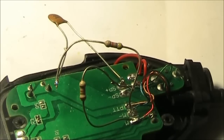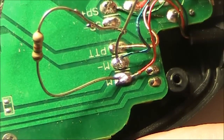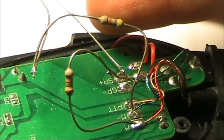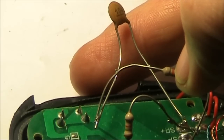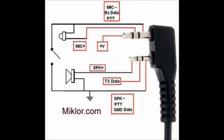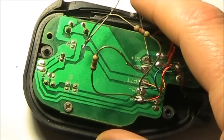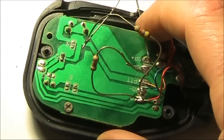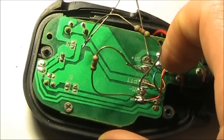I haven't had to disconnect any connections, but I haven't tried the speaker microphone to see if it still works with these parts connected across it. Across the microphone connection is a 1.5k resistor, wired between M-plus and M-minus. Going away from M-minus is a 47k resistor. The free end of that is connected to a 100nF capacitor, which connects to SP-plus. So basically we are taking audio from the speaker, isolating it with the 100nF capacitor, and attenuating it with the 47k resistor in conjunction with the 1.5k in parallel with the microphone.